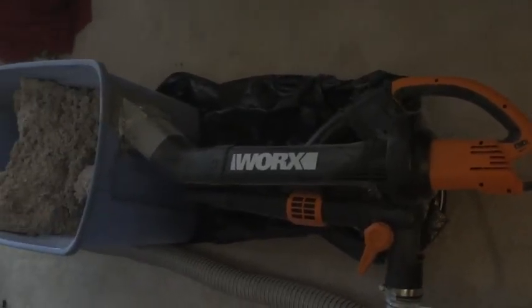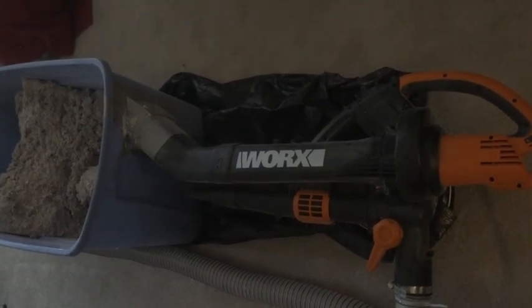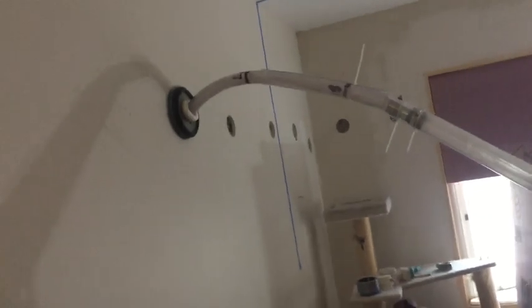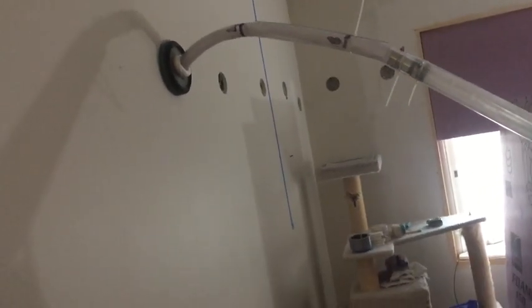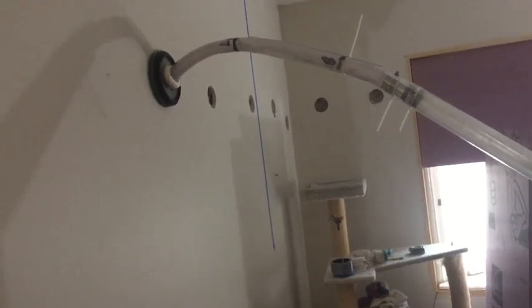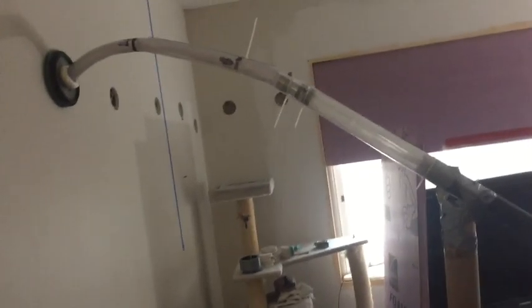I was told by David Paz that this should work, and I believe it works quite well. I have existing insulation in the wall which is only about a half or quarter inch thick, and I'm going behind that. It's faced, so that may act as a vapor barrier to the outside, and there's fiberboard sheathing on the outside, so I don't have a standard cavity size.